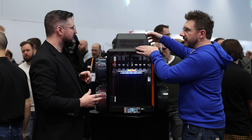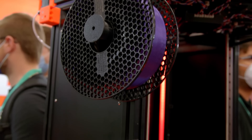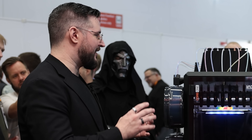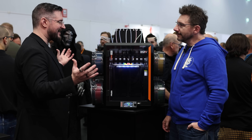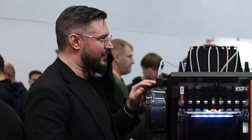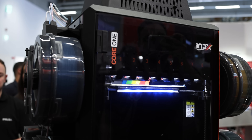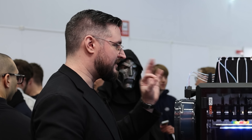With eight tools, spool management was a major concern — managing five spools on the XL was already a challenge. Prusa has spent a year and a half developing a super-optimized universal storage system with dry boxes that stack together. The idea is that once you have filament, you check if it's dry, dry it if needed, load it in, and it stays there until the spool is finished. This is fully integrated with the machine.